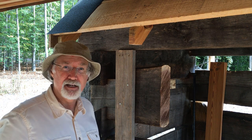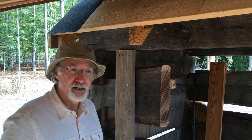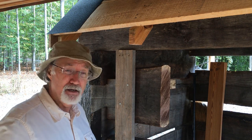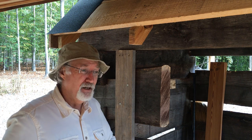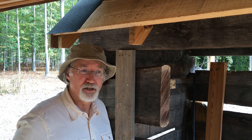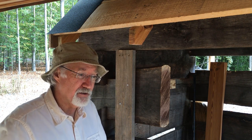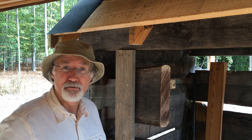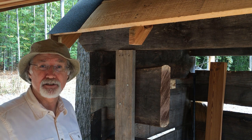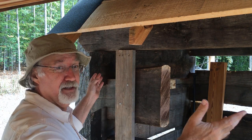On this particular shed I used a lot of white oak and also a bit of walnut — scraps from the milling of the logs themselves — which is a species relatively rot-resistant when exposed to the weather. I always do my gable-end fascias first, and then I do the fascia along the fronts and backs of the log cabin.